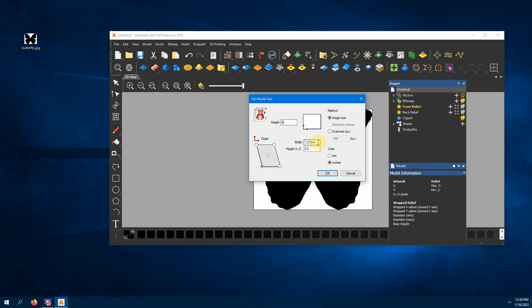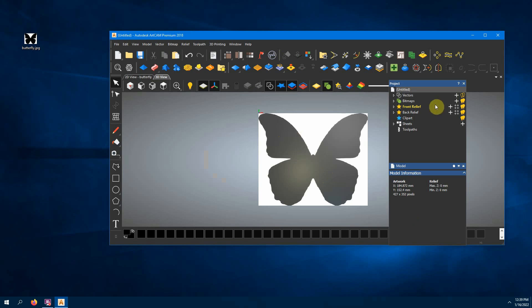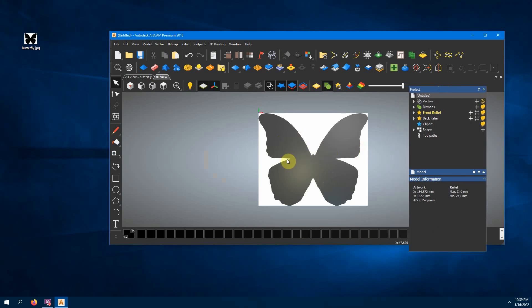I'm going to change it back to millimeters because my machine does like using fewer decimal places. This setting is for where you want your CNC cutting head to start. If you choose the upper left corner, it's going to cut the image to the right and below it. You could start in the center and measure out in all directions. For my piece I'm going to start with the head cutting in the upper left corner because I have a nice square piece of plexiglass.